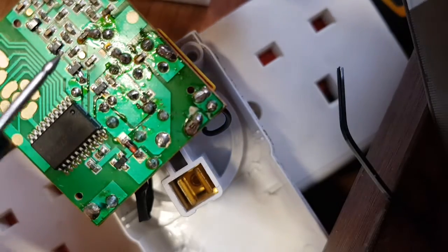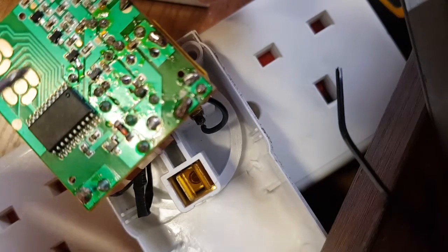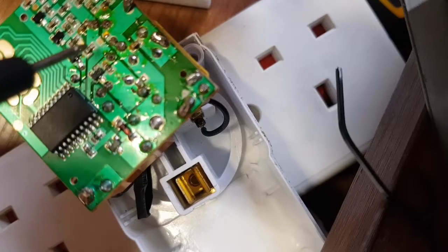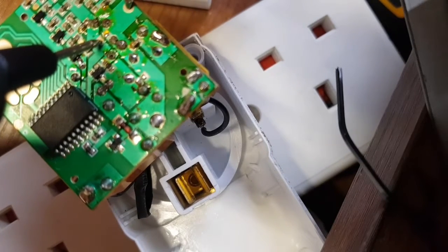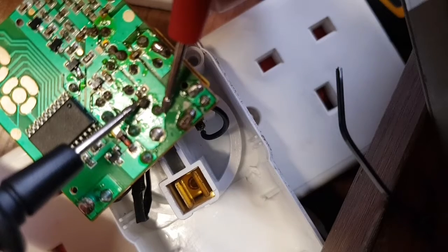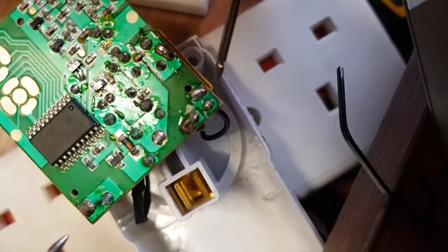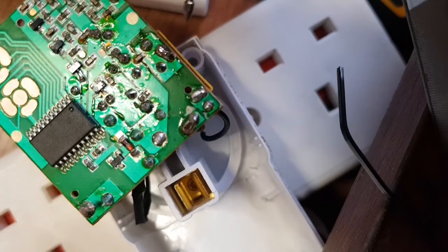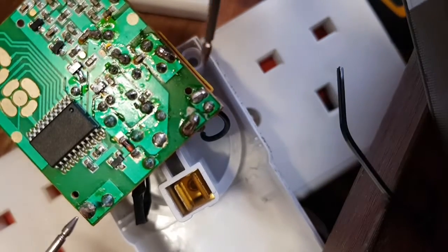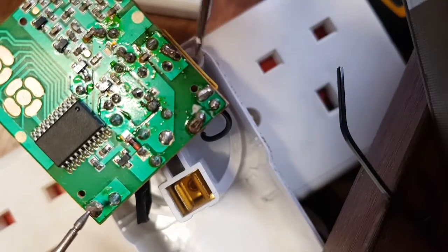Right, this is live. That's probably ground so I'll swap this around. Measuring zero. There's no power — interesting. So where's the 400-volt cap? The 400-volt cap point is here — 0.3 volts. Interesting. Let's go to AC — should measure our supply here and here. 14 volts? That's not right.